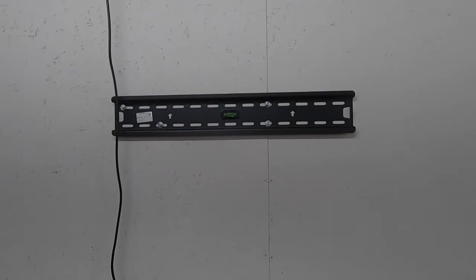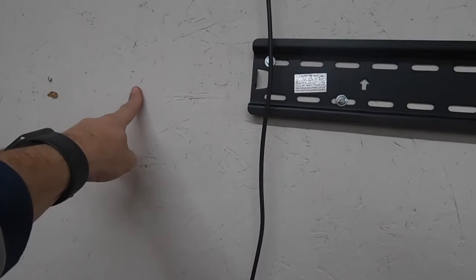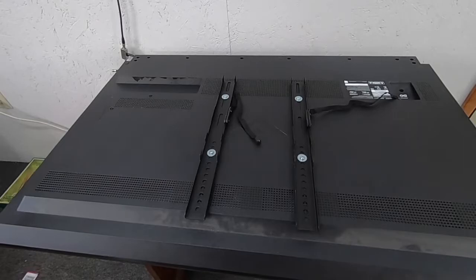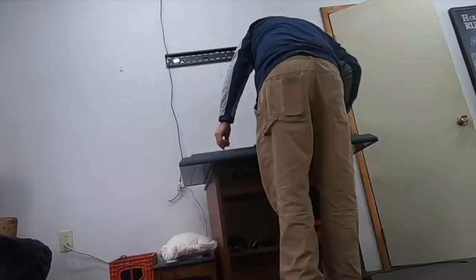All right, here's your instructions. Step one: find a stud — in this case, it's on this side of the camera. Good one, right? So I found a stud here. There should have been one here too, but evidently it was on two-foot centers, so this one's not on a stud, but it's in this plywood so it's fine. They make these mounts now with a built-in level. Level it up, screw it in, find the screws that go in the holes already there — they give you several choices of screws to fit. Then all you've got to do is plug everything in, and this hooks on the hooks there, and we'll be good to go.